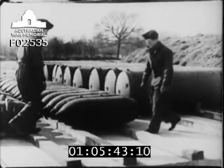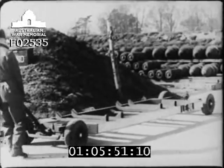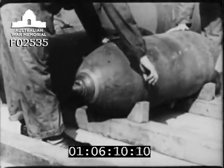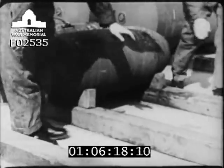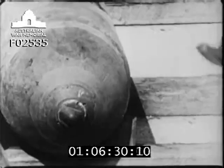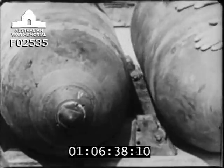When rolling bombs from single-tier stacks onto trolleys, a C-type trolley is first wheeled into position. It should arrive parallel, and as near alongside the ramps as possible, with the first pair of cross-members lying opposite the ends of the batten. Next, remove the chocks on the near side of the trolley, then remove the wooden chocks from against the first bomb. As the bomb is moved out, chocks are replaced in position against the second bomb in the row. When rolling the bomb onto the trolley, it occasionally happens that the lug impinges onto the edge of the trolley. It will then be necessary to roll the bomb backwards and rotate it very slightly, using two roller chocks placed against the chocks already holding the remainder of the bomb.